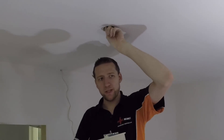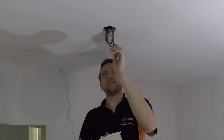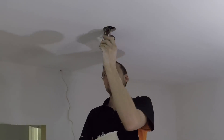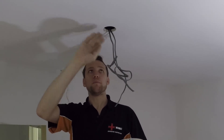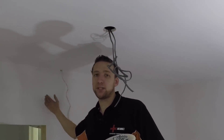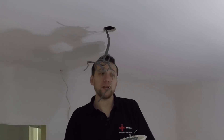One thing I should mention to newcomers: if you've put your downlights in during a rewire, it's worth remembering to neatly coil up your wires and measure where they are. Also make sure to find out if any of these walls are changing — if a stud wall is being put in, or if it's being dot and dabbed — and try to take into account anything else that could be changing. I've made that mistake where I've come back two weeks later to do a second fix and suddenly the wall that was there has disappeared.